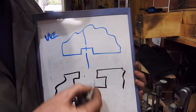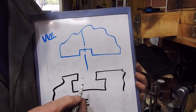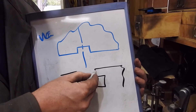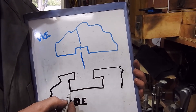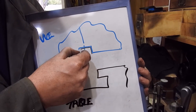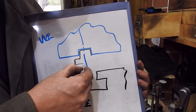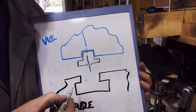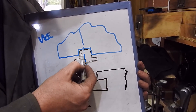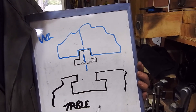How do the keys work? Basically what you're looking for is something that will locate in that slot in the vise, attach with the screw, and then locate in the T-slot. When I first did one of these, I got all excited because I thought it had to be a tight fit there and quite deep because the T-slot tops on the table are quite deep. I made the job a lot more complicated than I needed to. What you really only have to worry about is getting a good tight fit in the T-slot. It only needs to be five to ten millimetres deep. When making up your key, all you're worried about is that it's a snug fit in the slot on the vise and that the screw lines up. You could use a countersunk screw, a socket head with a counterbore, or various other methods.